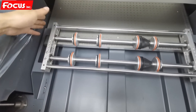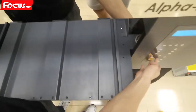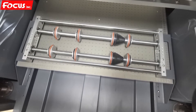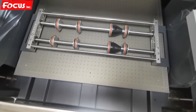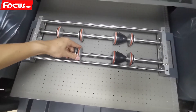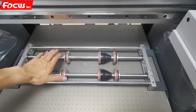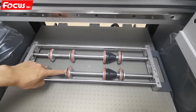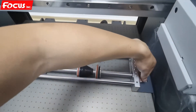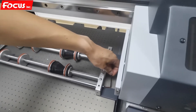After locking the jigs, we adjust the tension of the rollers on the table. We move the table to the front from the control panel. We must ensure the rollers are not too tight or too loose — when we move the table, the rollers should move freely. If too tight, we adjust the screws at the left and right sides. There are two rows of adjustment screws, one at the front and one at the back.